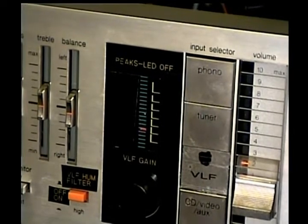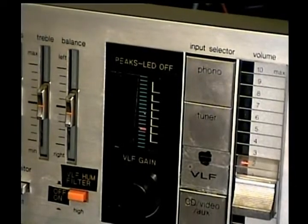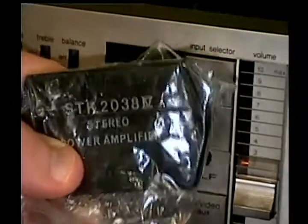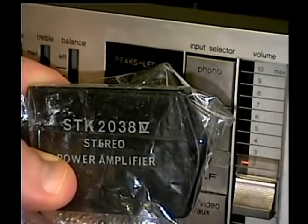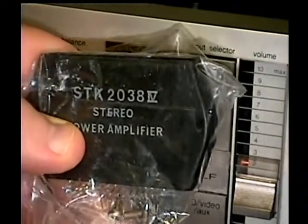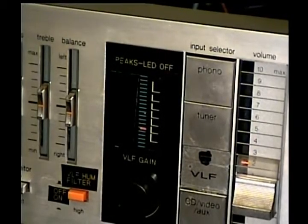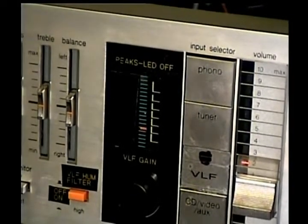The output amplifier repair was really difficult because the STK — I think it was like a 2040 — let's see, this STK Darlington Power Pack is a real hard part to get. Here's the old one: this is an STK 2038 version 4. I managed to locate a vendor who had the part, but they tried to save me money by sending an STK 2038-2 version. That didn't work at all because this is a 16-pin Darlington Power Pack and the one I got was 22 pins. Had to give up on that. They wouldn't accept the incorrect part and give me credit toward the correct part, so I had to engage in some perfboard piracy.